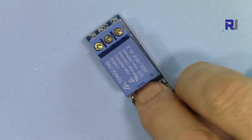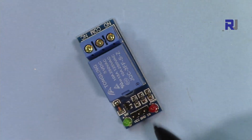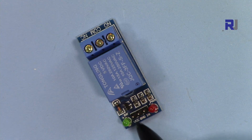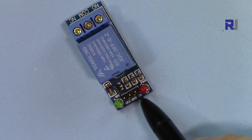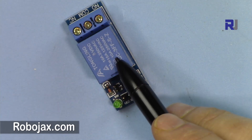When connecting your wires, you always put one wire at the middle (common) and the other wire at either the normally-closed or normally-open terminal. The relay works with five volts. On the left side it has three pins: VCC which needs five volts, ground or the negative wire, and the input where you send the signal to activate the relay.